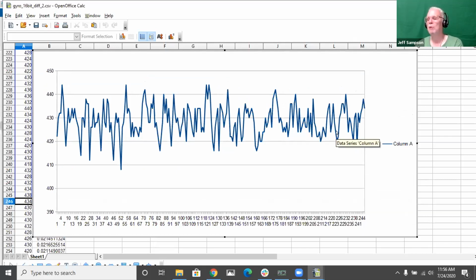So my problem was I needed to feed both of those signals into the differential inputs. I couldn't do the 0 to 5 volt; I had to do 0 to 3.3 volt. But when I added the voltage divider, it loaded the thing down to the point where it was screwing up my signals. So I'm going to put that op-amp buffer in between, so they're both buffered with a nice low impedance output, and then try the whole thing again. That's giving me more hope that this is going to work.